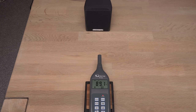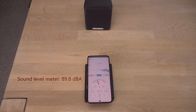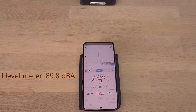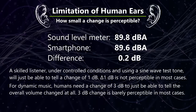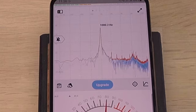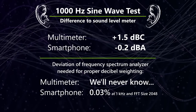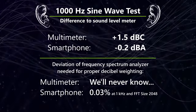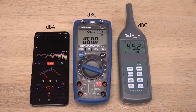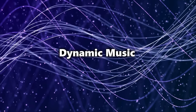Now for the smartphone, this time in A-weighting. The sound level meter reads 89.8 dB. Not only is the reading very, very close, but the spectrum analyzer peak is also spot on. This is looking bad for the multimeter — especially since my particular unit reads around 60 dB even in the quietest room. It is supposed to go down to 35 dB, not 60.